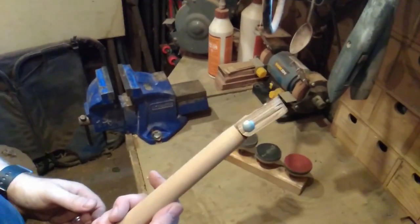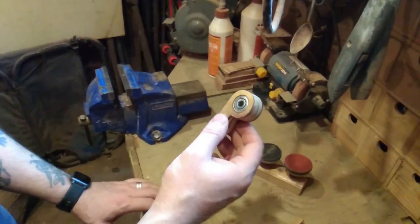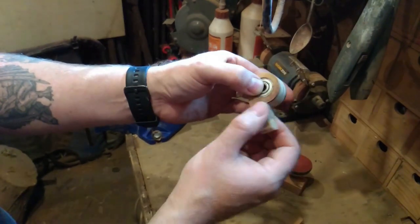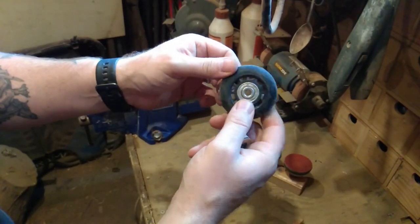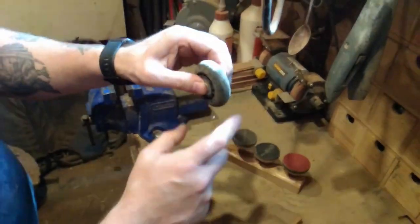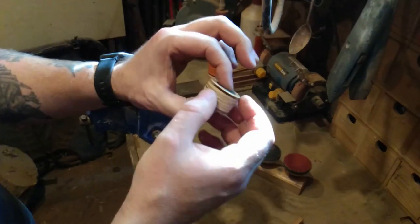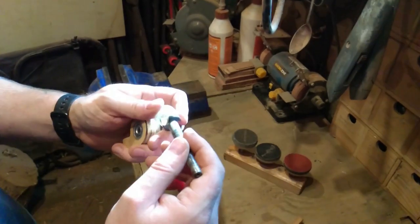That's why I made my own, but this is a really simple thing to make. If I take it apart and show you the various bits: to start off with I've got a bit of plywood which I've cut into a D-shape. There are a couple of ball bearings in there - those came from the wheel off an old rollerblade. I used a load of those a while ago to make a steady for my lathe as well.